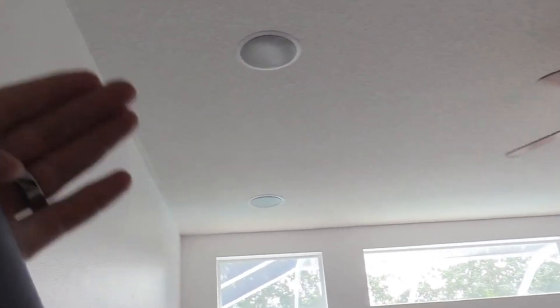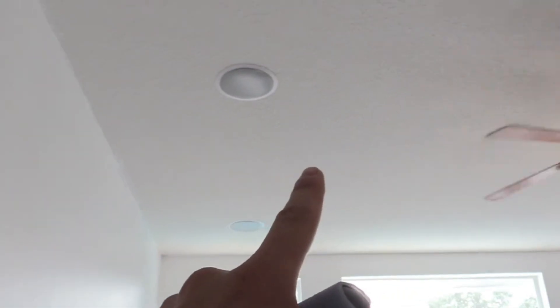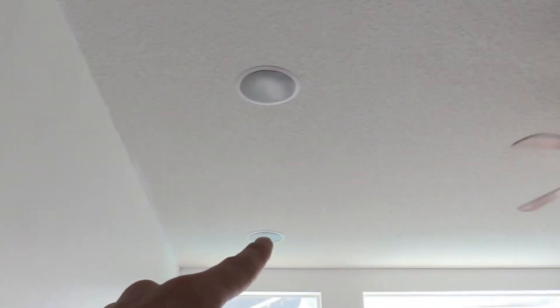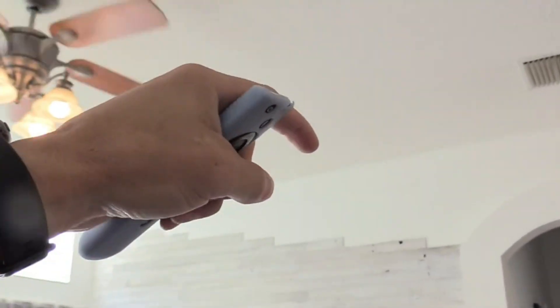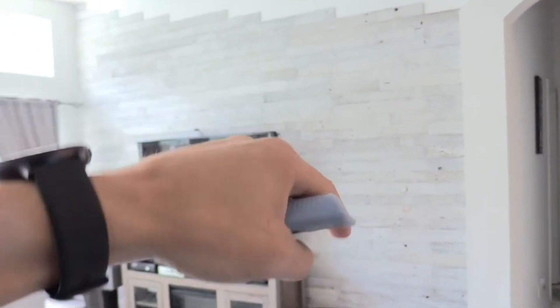The installation is finished and it went pretty smoothly. I ran the four-in-one cables along the speaker wires, then split the four-in-one and connected the red and black wires to the right speaker and the white and green wires to the left speaker. The only issue was finding a piece of wood between the joists, so I had to move the template three or four inches further from the wall and match the second template to it. In the attic, I ran the speaker wire down the existing coax cable hole and down the wall, connecting to the speaker wire plate.